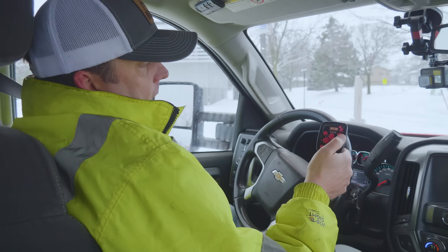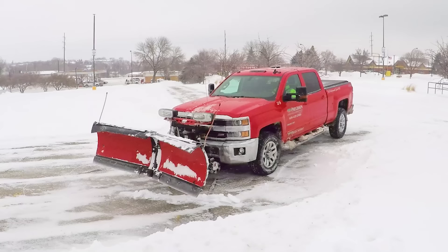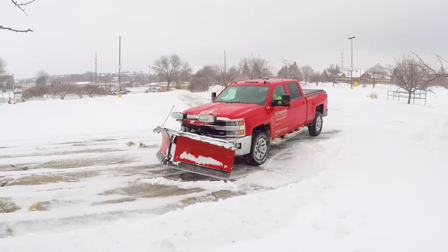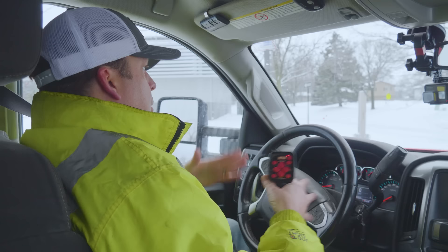And then on this side is the retract. So this is if you were to do any trail clearing or maybe even a narrow driveway — this is great because you can go down in a V. I almost call it like a train. You ever seen the train videos where they're going through? This will just push snow off each side of you. Not really practical on a commercial job — you'll see a lot of the city trail guys running down trail paths. Because if it's about the width of your truck, that's perfect formation — just go down once, push it out both sides evenly.